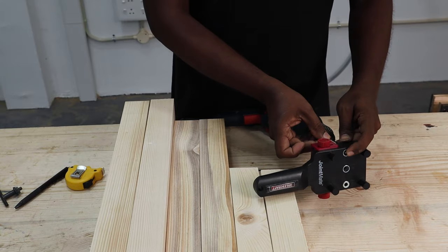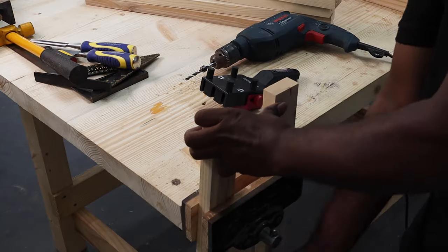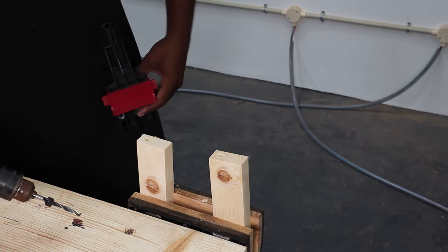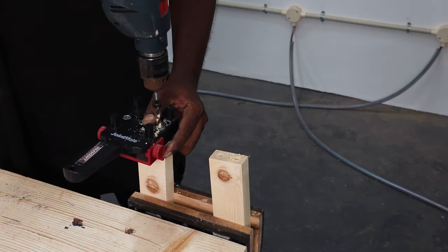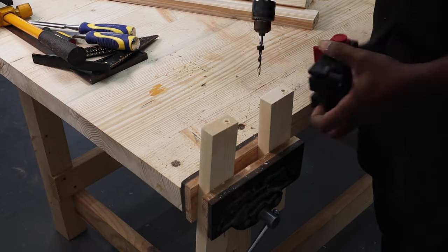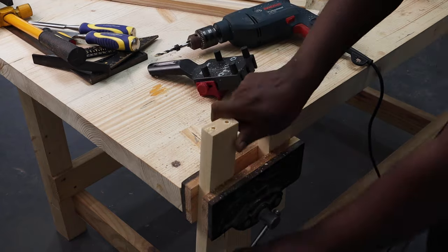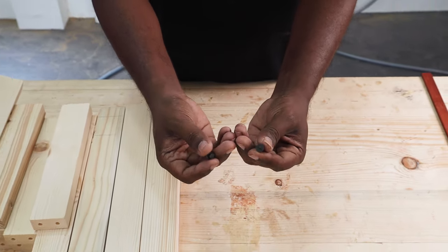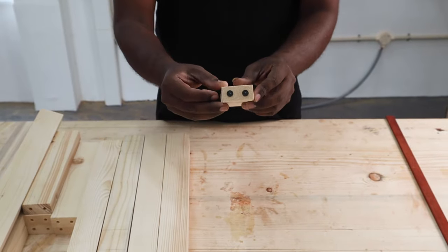For this, we use the drill and the dowel jig in combination. The dowel jig helps set the size of the drill hole and helps it stay vertical while drilling. You want the dowel pin to fit in snugly when hammered in with a mallet — the hole must be just right, not smaller or larger. To ensure uniform depth for all dowel joints, we need to set a drill stop on the drill while drilling.